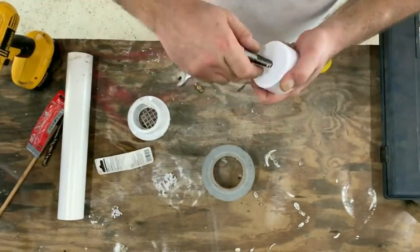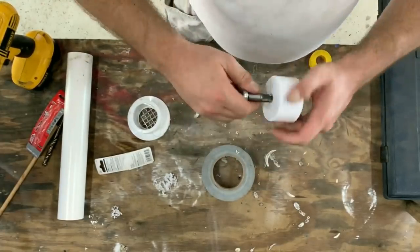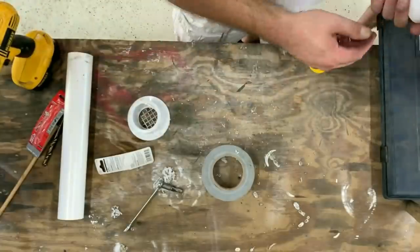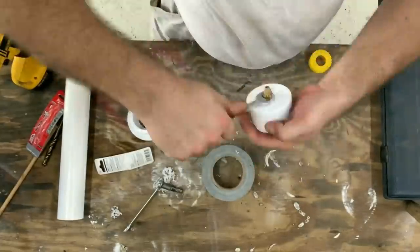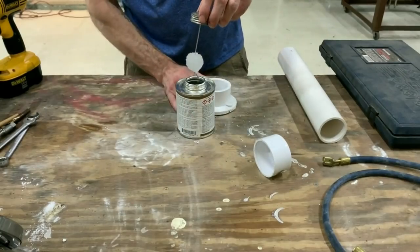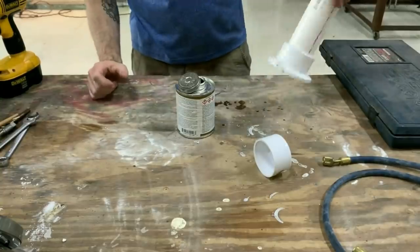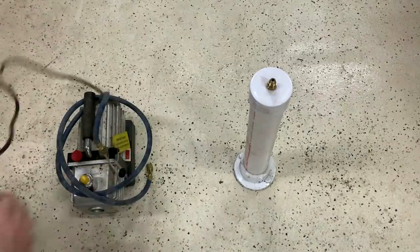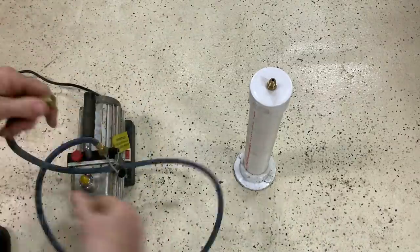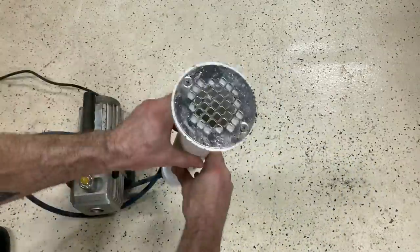After seeing how well the Epoxycast 690 flows, we realized that using the vacuum chamber probably wasn't really necessary. But we still needed to find a way to direct the epoxy into the channels of the nest without making a bath big enough to submerge the entire thing. In the end, we devised a scheme using an AC vacuum pump, some PVC parts, and a contractor bag to force the epoxy into and around the nest.